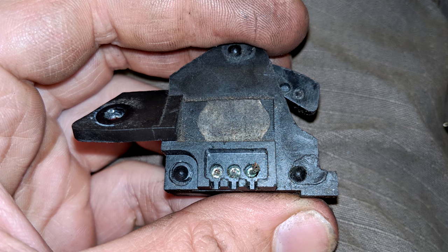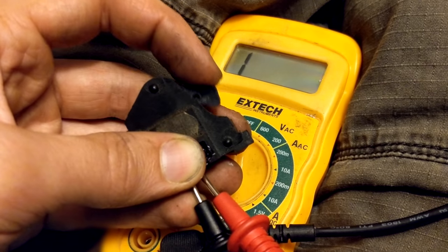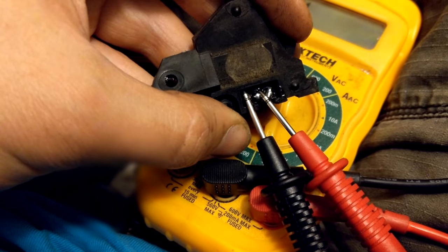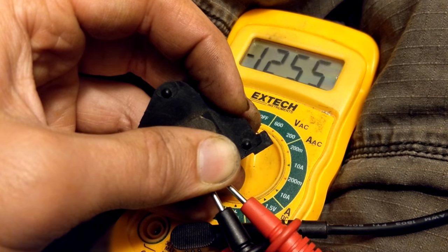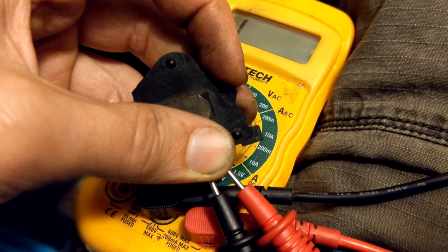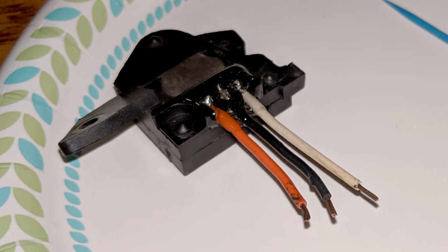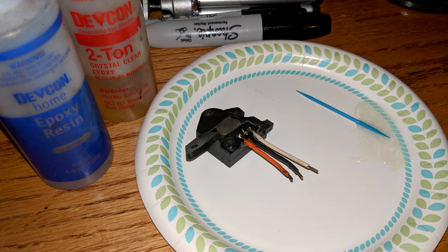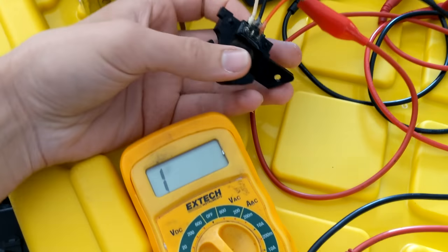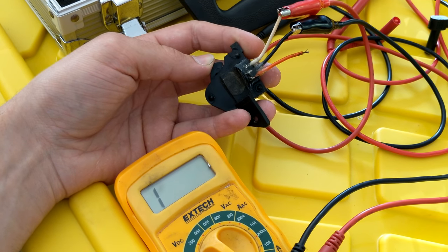It was pretty tricky, but eventually I was able to get little dots of solder on each of those connection points. With that in place we'll use a multimeter to test the switch, so we know it mechanically works before we spend all this time trying to get wires attached to it. With the leads connected to the left side and middlemost contact, these two are normally open and when the switch is activated this circuit closes. With the center contact and the rightmost one, the switch is normally closed and when activated the circuit opens. Our little dots of solder appear to be attached, so we tinned up three little wires and connected them to the switch. Just like the other switch, after soldering we'll apply some epoxy to hopefully take the strain off those little connections.